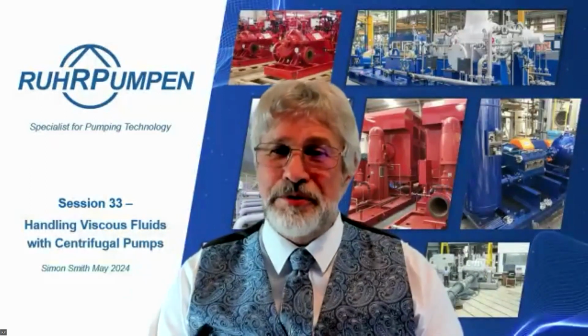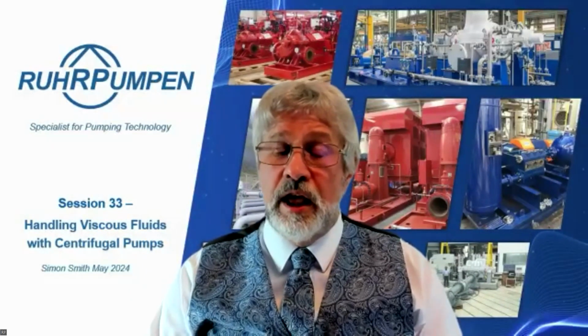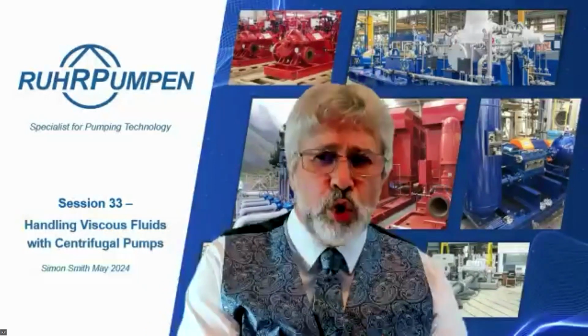If you've got larger pumps that are with medium type of specific speed or into the Francis vane region, then they're far more forgiving and they accept more viscous flow. So then if you've got quite high viscosities and higher flows, that B number comes down. So I think that B number will be higher for small pumps and lower for large pumps.